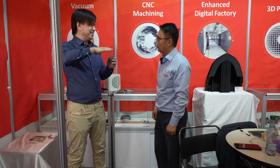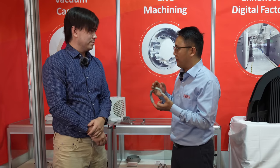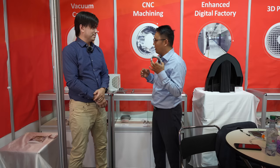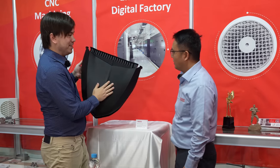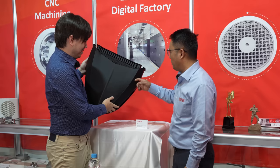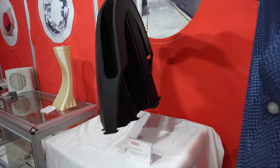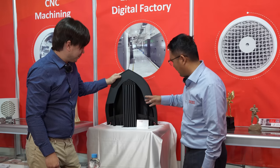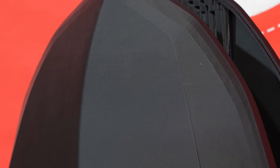The traditional way to make this part is by metal casting, which needs a mold first. That's why 3D printing for making this part is very cost effective. This is a very large part — what type of material are you using on this one? This one is carbon fiber with nylon. There's a lot of material in this part — it takes almost five days for printing. It still has the support material on here; we just want to show the customer how the parts come out. Usually we'll remove the support material before shipping to customers — quality must be very good.